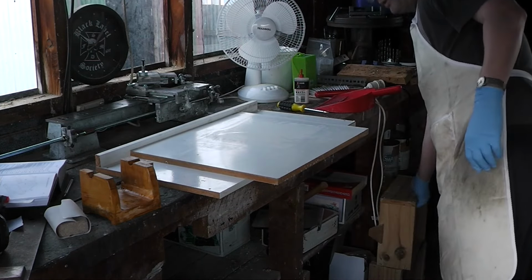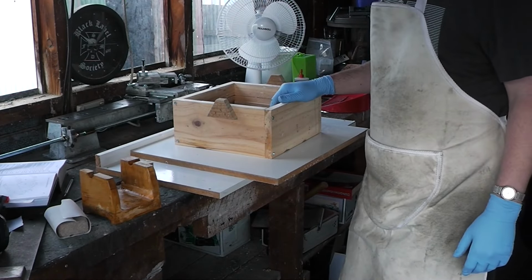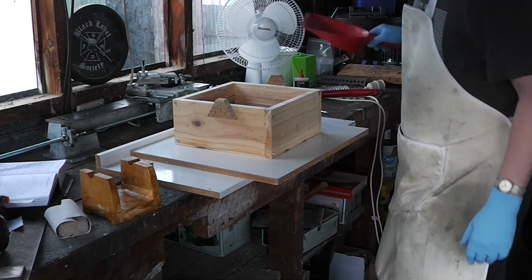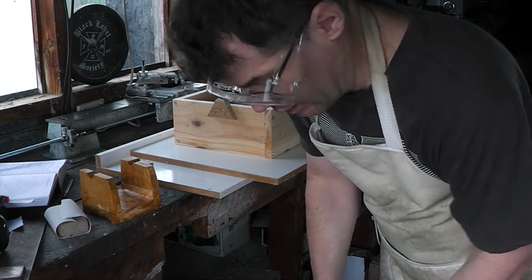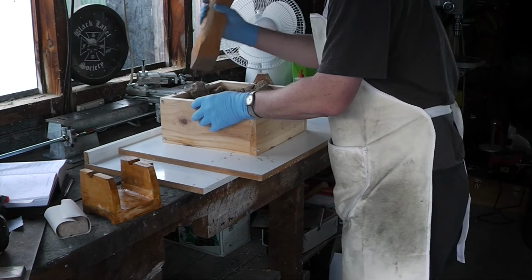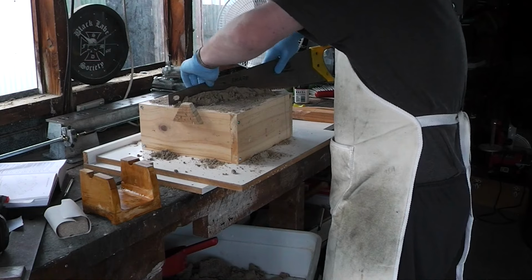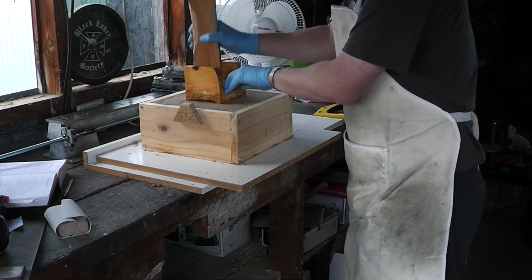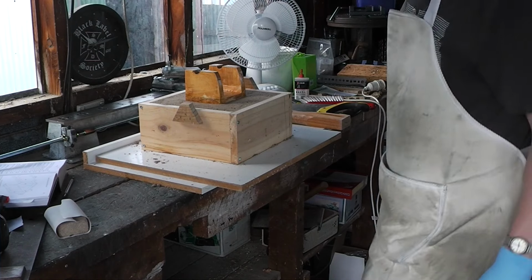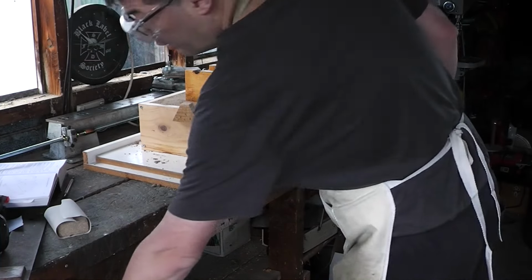Going to ram up the permanent headstock casting. Going to use a false cope, which will be a double rollover. Hopefully I don't screw this up. I'm glad I made that out of wood now. If I'd done that with a 3D printed pattern, it would have broken with the amount of force I needed.